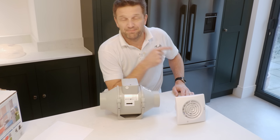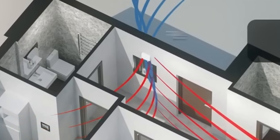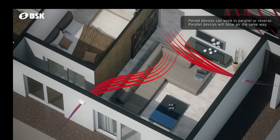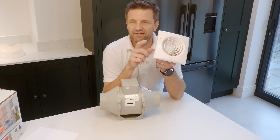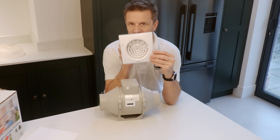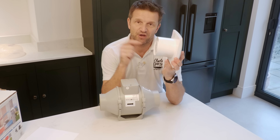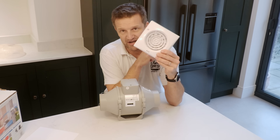We've got two concepts to grapple with: decentralized ventilation systems as opposed to centralized on one hand, and then simple extraction ventilation as against extraction ventilation with heat recovery on the other. Decentralized ventilation is something you'll be familiar with because pretty much all of us have at some point had a bathroom with an axial fan like this. These are meant to be installed in a particular orientation and have very short duct runs through a brick wall — so many bad installations happen because people try to put massive long duct runs on a fan like this.